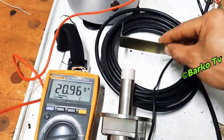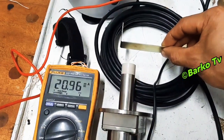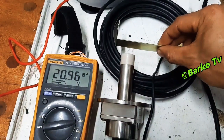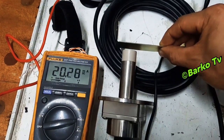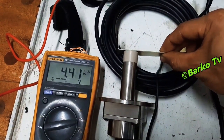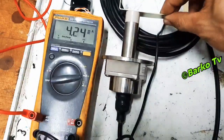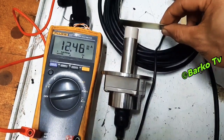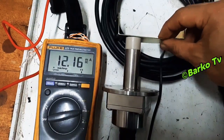There is no object detected at this point. When the plunger hits within a certain distance of this induction sensor, 20 milliamps is the maximum reading. The minimum is 4 milliamps — that is when the object is actually hitting the sensor. This reading confirms this sensor is good.